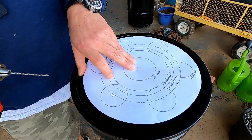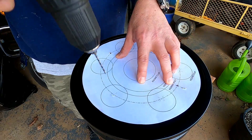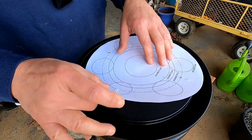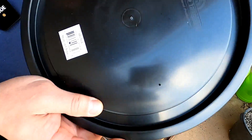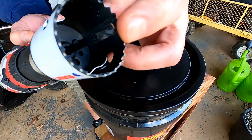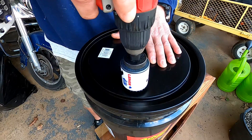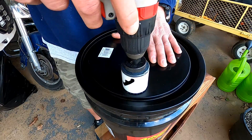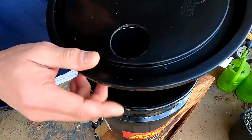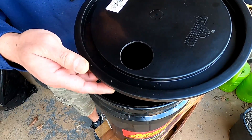Now that we have our template in place and it looks good, I have another drill with a drill bit on it. All we're going to do is create some pilot holes. So we drilled out our pilot holes — we don't need the template anymore. We're going to grab our hole saw and take the point of the bit right over that pilot hole. We start off in a forward direction until the hole saw makes contact with the plastic, then run it in reverse so you're left with a hole that's nice and clean. We run it in reverse so we don't rip the plastic, because then we'd ruin the lid and have to start all over.